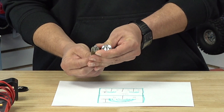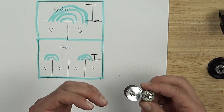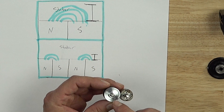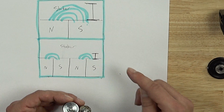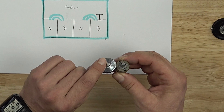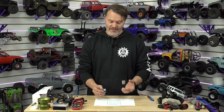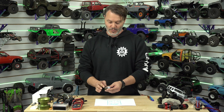On the new 10-pole I've designed, you can see a much larger diameter rotor, and I used math to optimize it. We're not losing magnet capacity — it's optimized on the back iron path. If you use the same stator for both 4-pole and 10-pole, the back iron path isn't optimized for the 10-pole, so you get better load-speed control and better resolution, but not the same peak power as the 4-pole. When optimized with a large rotor, we have more room for magnets, an optimized back iron, and plenty of copper — giving a motor optimized for torque density versus the 4-pole optimized for power density.